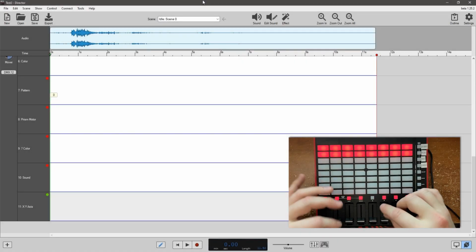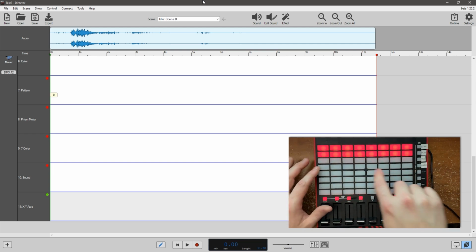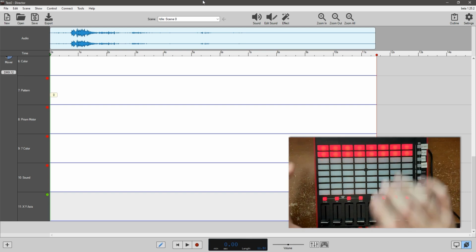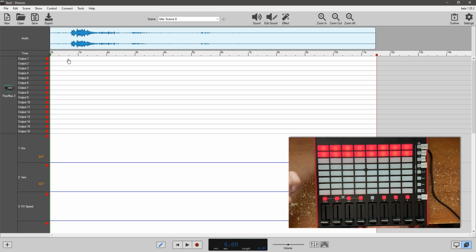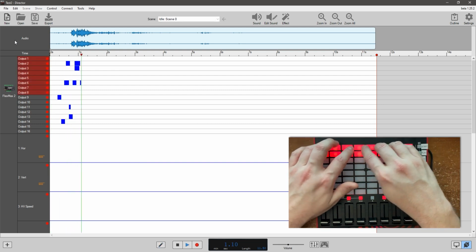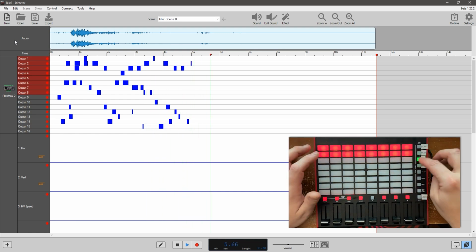Now, the sliders are not the only thing it controls, right? That's why these buttons here are like this. If I had more outputs on an I/O expander, these would be lit as well. These also allow me to control my outputs up here, right? So again, with the thunder sound effect, if I had some lights that needed to flicker or something to happen that was not dimmable, so it wouldn't be operated with these, it'd be operated with these, I could do the exact same thing. So if you watch, we'll hit record. Just pushing these buttons like this, and then there you go.